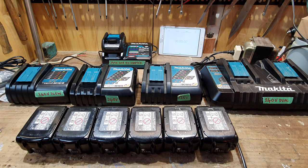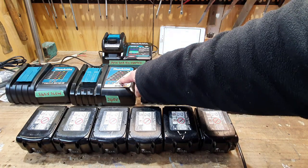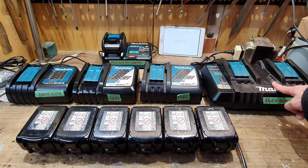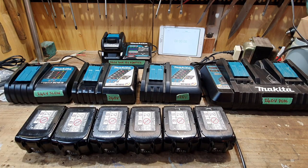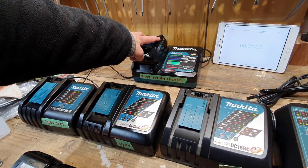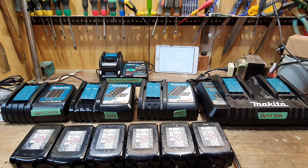We've gone from 120V rapid charger and 240V rapid charger — the DC18RCs — and we're going to keep these in the mix. Over here we've got a 240V slow charger and we've got a 240V dual over here. And we have six fully discharged 5 amp hour batteries. Right at the back here we've got something that is on everyone's mind at the moment: the XGT 40V charger, but we're adapting it down to 18V so we can get this one in the race with all the old school 18V chargers. And we're looking at a time of 45 minutes — it's what Makita says it should be for a 5 amp hour. Let's get this race going.